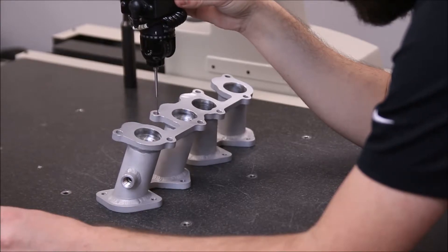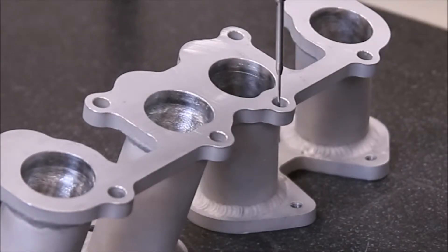So in order to get to the straight tube runner to keep costs and time down, I was able to model these nifty little templates that clamped onto the tube and allow me to just go in with a band saw right up against the nylon. The nylon didn't budge — that made nice clean cuts. All I had to do is deburr and blow off the tube and they were ready for welding.